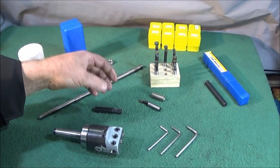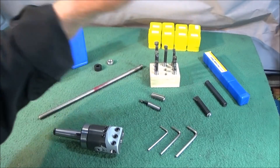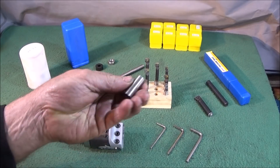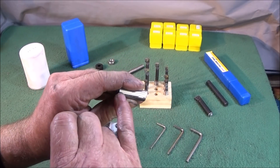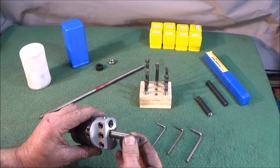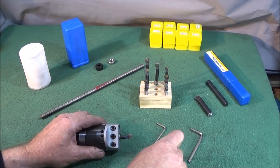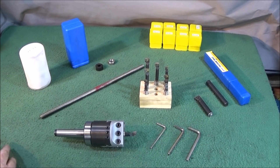You can get a set of 12 millimeter shank tools to fit this boring head, or you can get insert tooling and saw them down to whatever length you want. At the moment I don't have the 12 millimeter shank set — I have the 3/8 inch shank set. So what I've done is take a piece of 12 millimeter stainless steel bar, drilled it through for 3/8, and split it with a hacksaw. That split bush goes over the shank and locks up solidly in the boring head. The boring head comes with three Allen keys for all the grub screws.